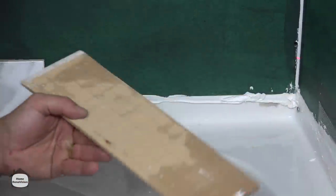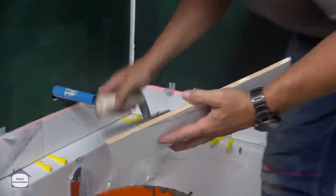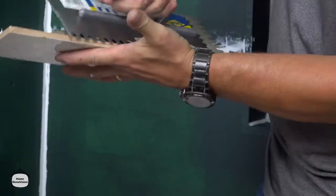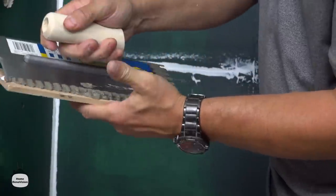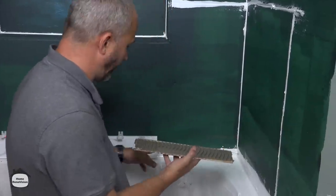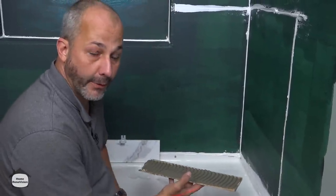Here's your option: you either cut the bottom of the tile to make your first row level so that your niche can be installed level, or you've got to wait to cut your niche in until after you've started installing your stone and then match this being crooked as well.